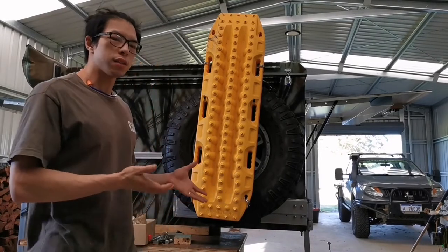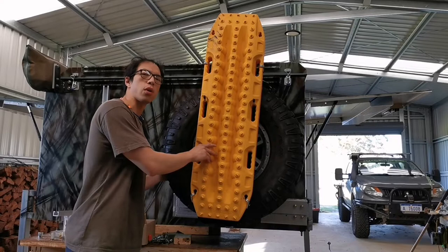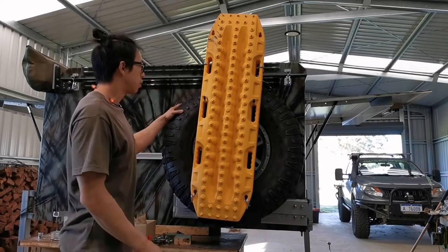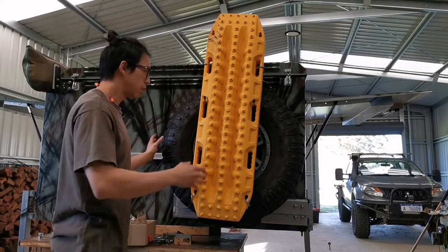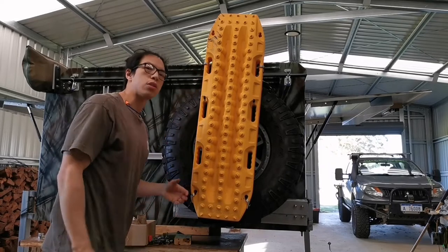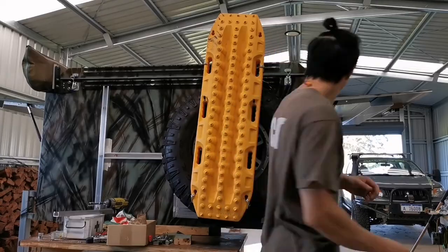Now, as you can see, the supporting bracket that I made just now, it blocks, it stops the wheel carrier from going in smoothly. Well, I guess it's something that I'll fix a little bit later, but what's important at the moment is that, you see, it doesn't want to come out at all. Because the concave surface of the bracket actually fits the arm very nicely. So now, it still swings, but then it won't actually come out. But of course, I'll still have to put a toggle latch on the side to make sure it doesn't come out as I'm driving.